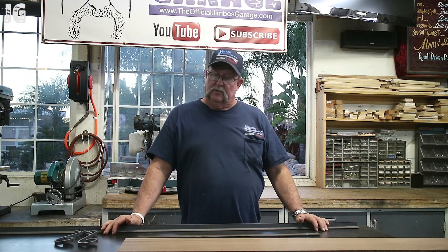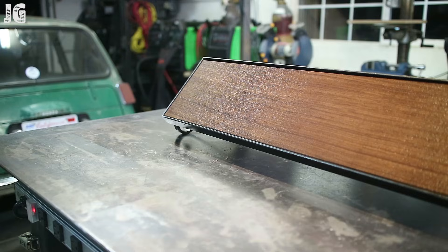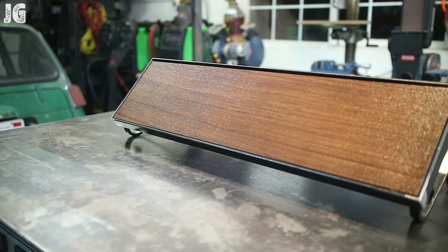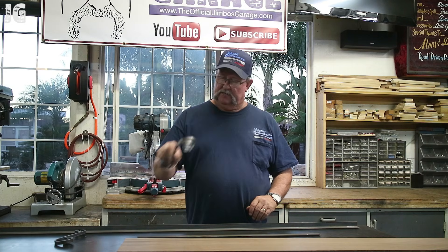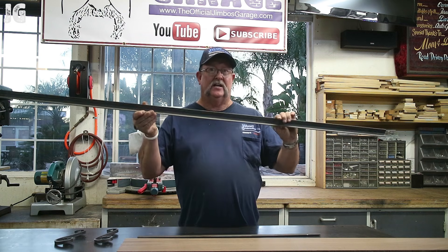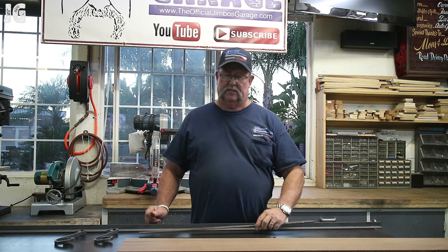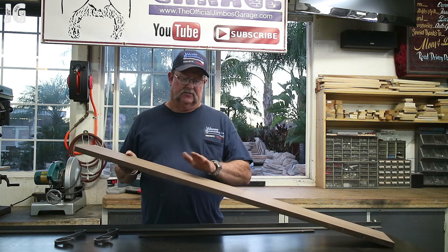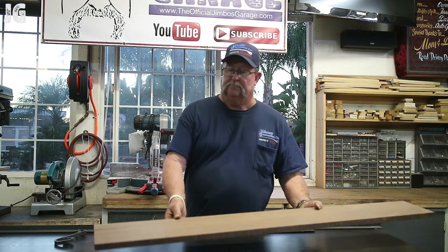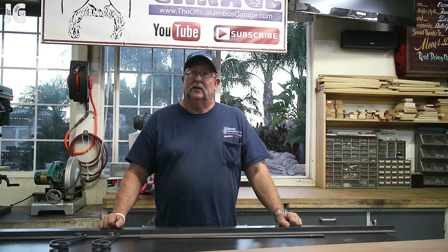Today I'm going to build a small shelf. It's going to be simple, kind of ornate — made out of some angle iron and some wood. It's going to be basically six inches wide, two foot long, with a couple of curly Q's on it. Made out of some one-inch angle iron frame with some one-inch by 3/16 strap, and a beautiful piece of walnut that we're going to trim down to fit inside. It's going to look really nice. Let's get started.